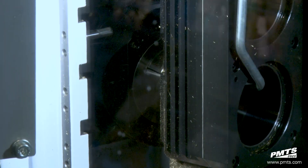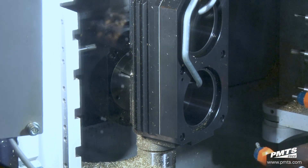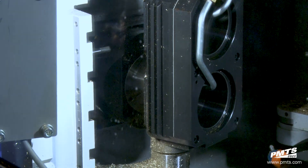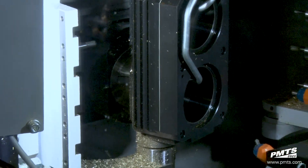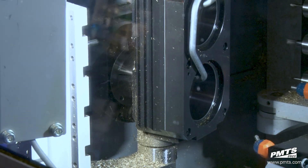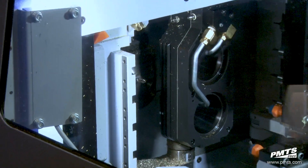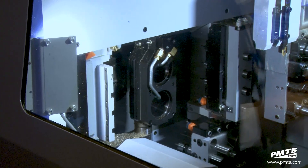As you can see right now, it's whirling the very front single lead. Each position of this whirling unit has two different form types — two different helix angles on the same holder. Inside the program, it's going to have a B adjustment for one thread form, and for the second thread form, it's going to have a completely different angle.